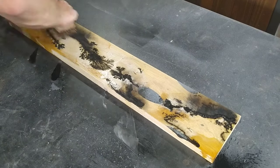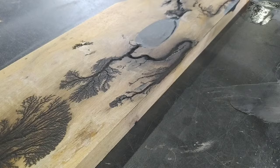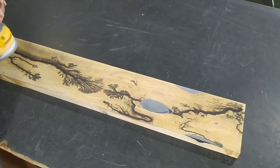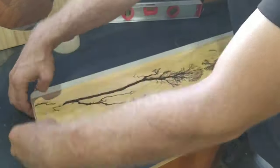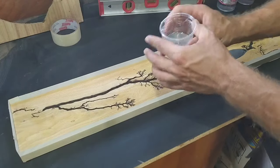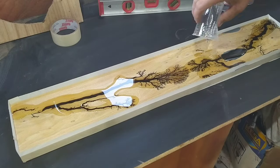As you can see, after burning it, the whole wood is quite messy. So after burning the wood, I clean it with a wire brush, then sand back all the marks from the burning and the leftovers from the watermarks, and fill the burnt areas with clear epoxy resin. This was really a satisfying part. The burn marks jump at you once you sand all the discolored areas, but once you put the epoxy on it, it looks beautiful.